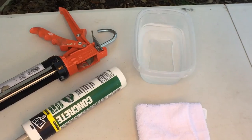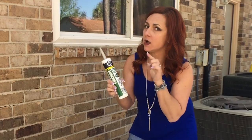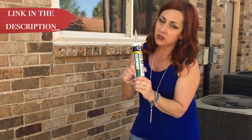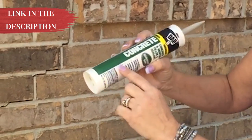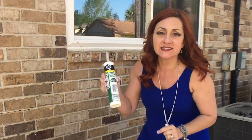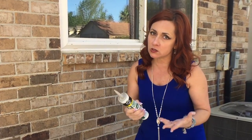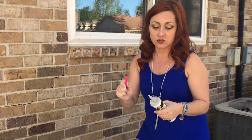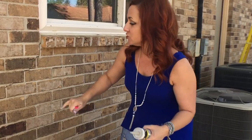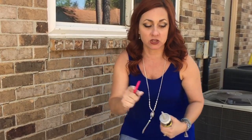So what we are using here: we've got some water, we've got a rag, and we've got the most important thing — I should have a link below — and this is the only concrete sealant I like. I've tried them all, trust me. This is DAP, the color is gray and it's called concrete and mortar filler and sealant. This is amazing, it's absolutely waterproof and it comes out exactly the color of mortar. What I like to do is cut off the edge about the size of the crack I'm filling because I don't want the sealant going all over the grout.